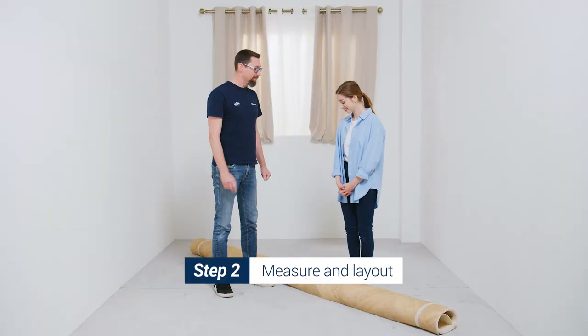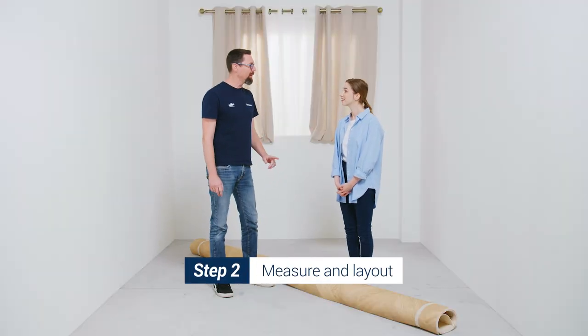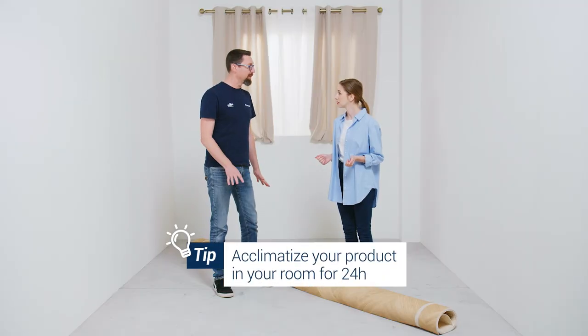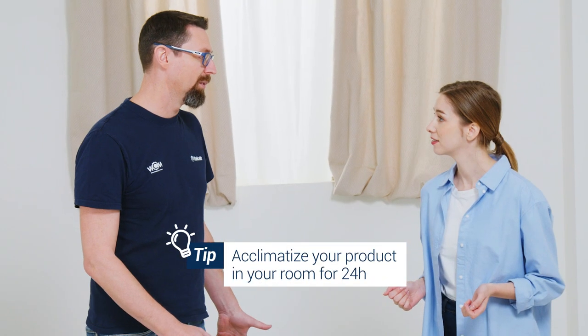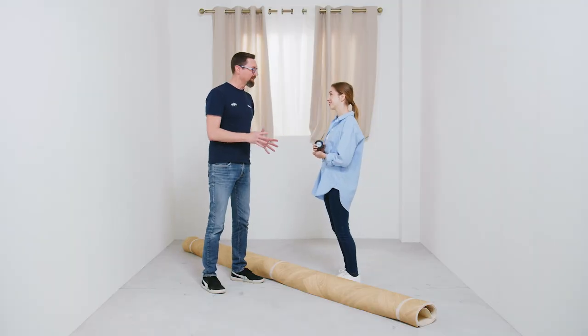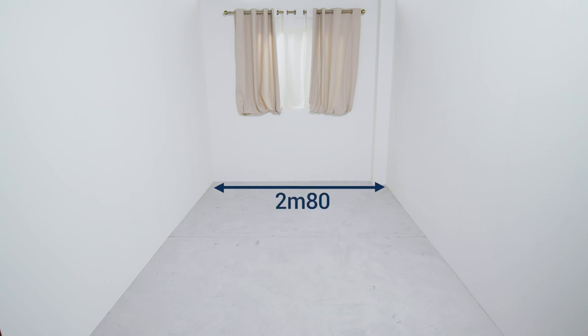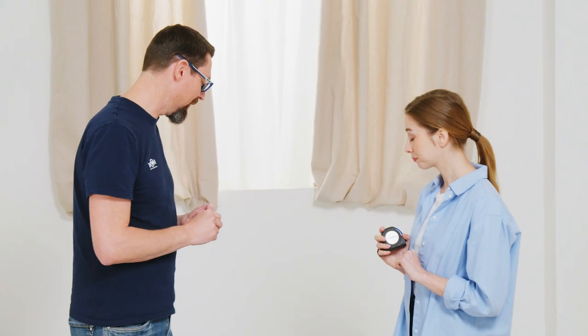So now the roll is in your bedroom. But before starting, did you acclimatize the product? I did, yes. I left it in my living room for about 24 hours, as the salesman told me. But why is this important? It's to have a softer material — you will see it's much easier to install like this. So I presume that to order the material, you have measured the size of your room. Of course. It's 280 by 4. Nice. So as you have a cut of 3 meters wide, we will have 10 centimeters on each side to adjust and adapt in case of mistake.